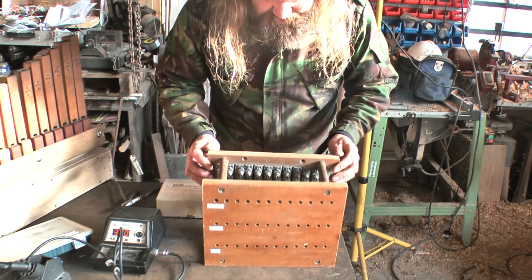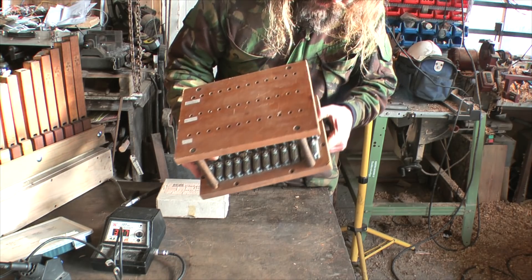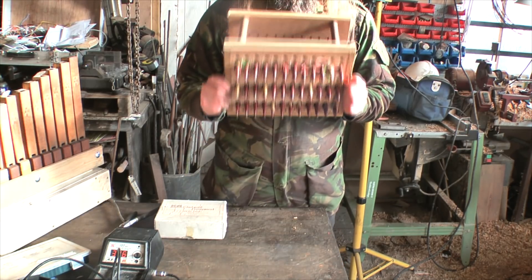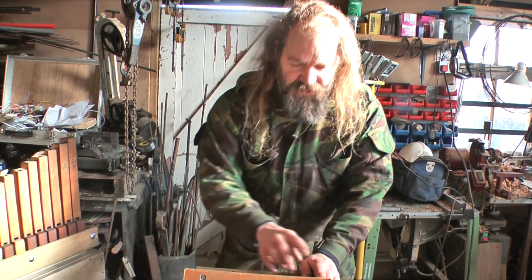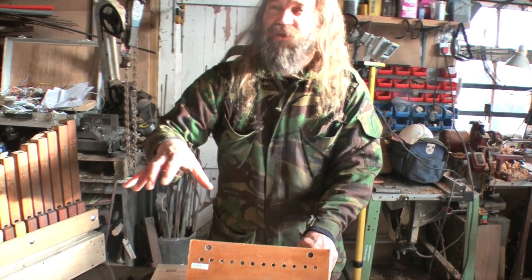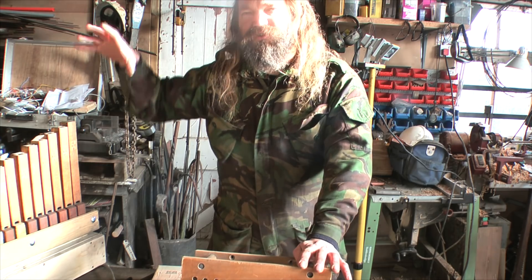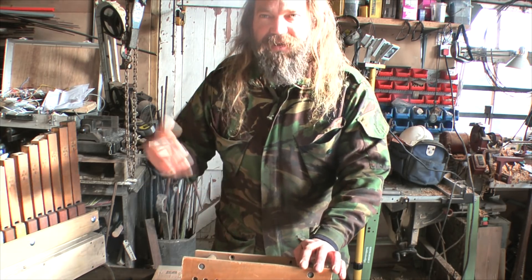This is what's known as a top note chest, used on a small pipe organ up in Norfolk. It's quite interesting — there's a whole bunch of electro-pneumatic chest magnets with little inserts that take pipe feet. This took three one-octave ranks of very tiny pipes that didn't need much air, so you can drive them directly off the chest magnet. The electrical contacts on the keyboard were set up through multi-contact switches so these were repeated at every octave. All three pipes in each rank played at once, but tuned to different notes, giving a chord effect — known as a mixture rank. The effect on a normal church organ acting on low pressures, which are all quite dull and miserable, is it puts a nice bit of top-end sparkle in. When you pull it out, it gives the effect that a small church organ is actually quite a big cathedral organ.